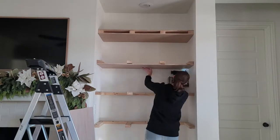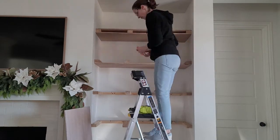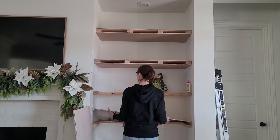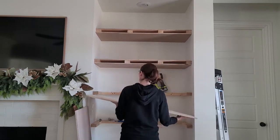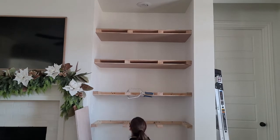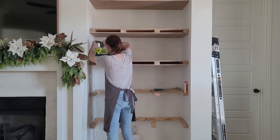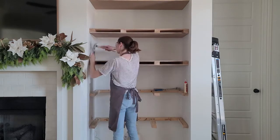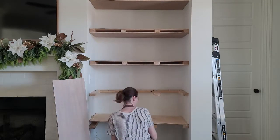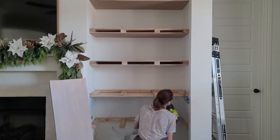I made sure the nail gun had the countersink deep enough that no nail heads would pop. I stained my shelves first — staining them in the garage was much easier — and if you like this stain color I'll put a link to the process in the description. I decided not to fill the nail holes with wood putty because they were so subtle and tiny, adding just a slight rustic look. I did caulk the sides and back of each shelf top for a nice smooth finish look, but otherwise I kept a more raw finish.